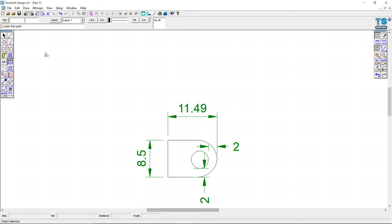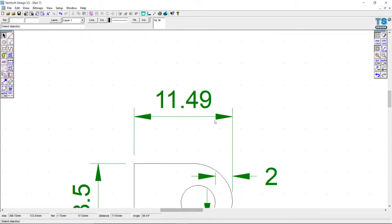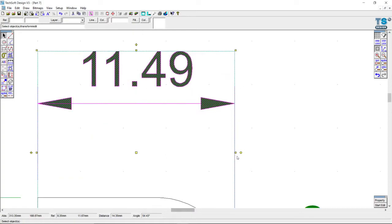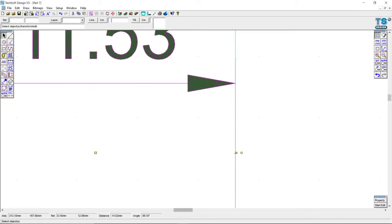We have, this is a toy kit, and I have by measuring identical parts found that there are quite large tolerances on some of these parts. Identical parts can be up to half a millimeter apart in some cases, which in engineering terms is unacceptable, but this is a toy, this is not a part for an airplane or a racing car, so they are acceptable tolerances.